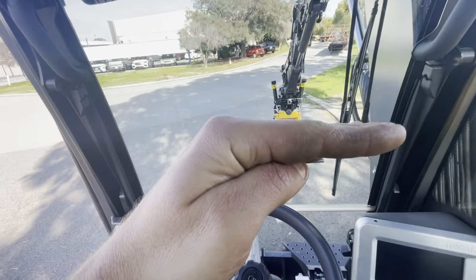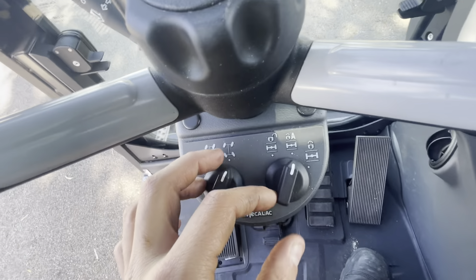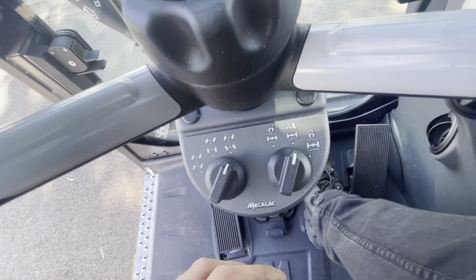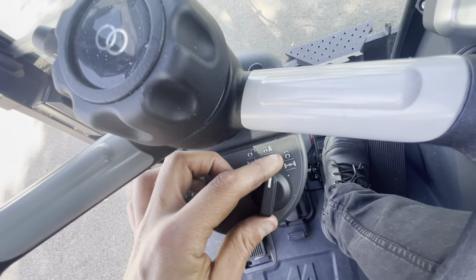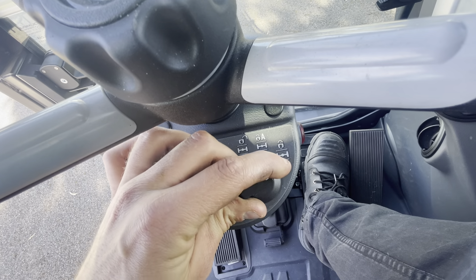The oscillation lock is for your wheels when you're going on undulating ground. On automatic, when you put the brake on, the lock comes on; when you take the brake off, the lock comes off. Pretty handy, but you can override it — leave it unlocked at all times or all locked. So you choose what you want to do there.